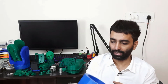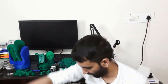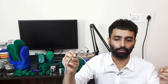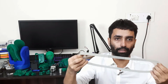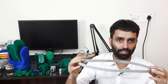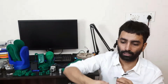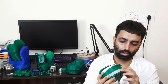And these are the belts which I ordered from Montana International. Their link is in the description. You can contact them based on the size that I mentioned, and you can place the order. And these are the final versions of the belt. They have the perfect teeth. These are T5 belts, and they have the perfect teeth which align with the teeth of the 3D printed part. It gives better torque and grip over the parts, and when we assemble them, it will give us less slippage.